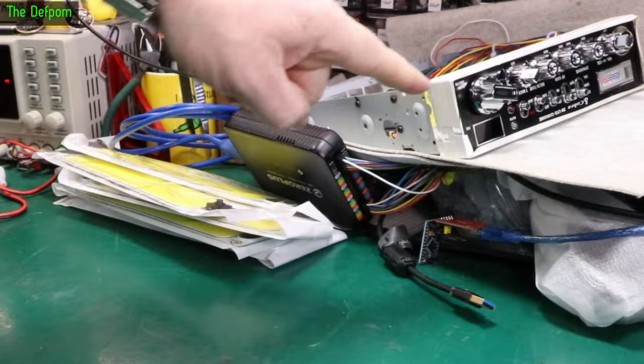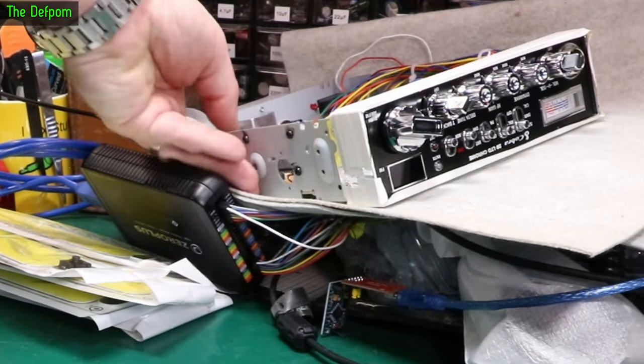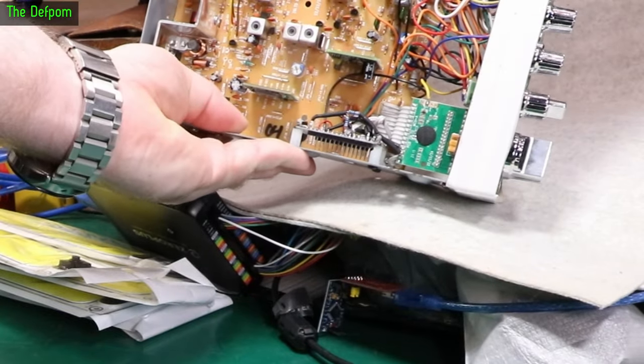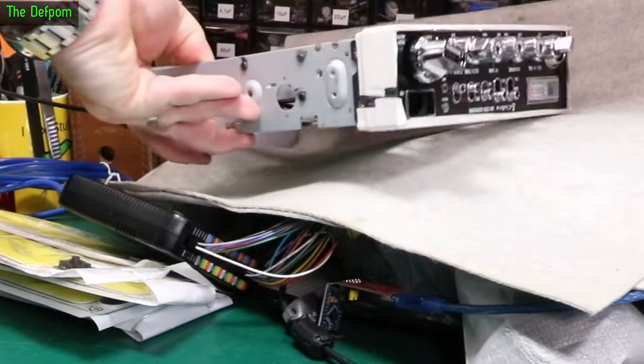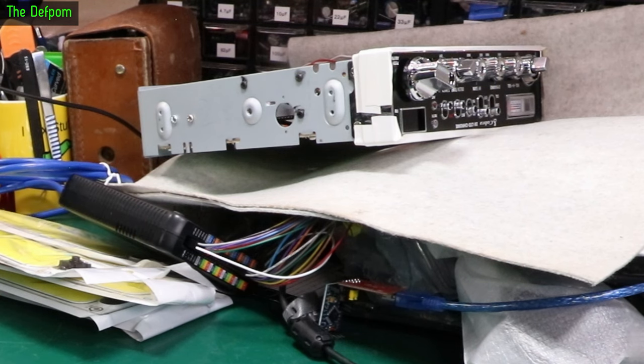This isn't the same - this is different. This is an AM FM one. It's got FM on it, and it's got a microcontroller in here with no mixer circuitry for the transmit side. The microcontroller's up here and that's what controls it all. So I'm in the process of designing a modification for this. I'm getting there, it's not quite finished yet. I'll do a video on that at some point.